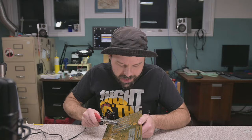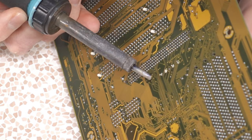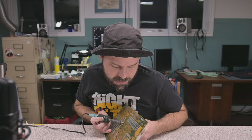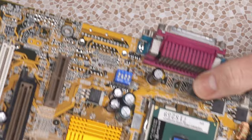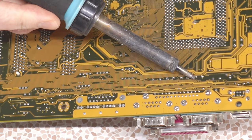That last solder joint's being a bit of a nuisance. Let's see if we can peel on this — that's one side, that's two sides. Now the next one. I'm getting some strange smells off this that I didn't recognize. Now I have five of these and I've only pulled four — yeah, there's one more right there that has to go. Five bad caps removed.